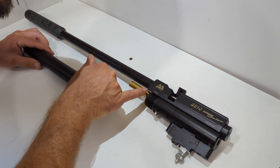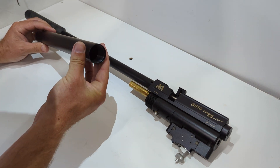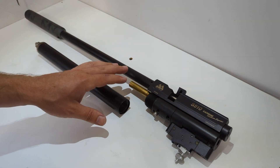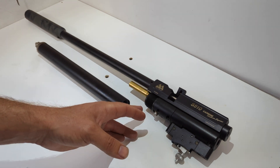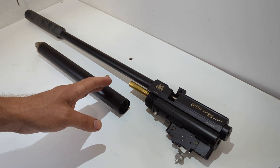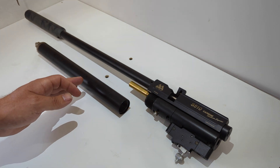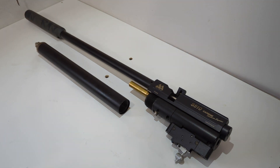Right, so the cylinder's off. There's no signs of any scale, any green verdigris, or anything like that on the pot itself. There's nothing inside the cylinder that looks like corrosion or anything like that — I've tried to photograph it but absolutely can't get a decent picture. You'll have to trust me on that, but I'm quite happy to actually refit this. I'm just going to re-lube it, put it back together, and then get the pump on and see how long it takes to fill from empty. Interestingly, you have to cock these when you fill them. Normally you'd use a dive bottle to give it a quick blast to seal the valve. I'm not sure whether the compressor will have enough pressure quickly enough to fill this even with it cocked, so we may need to get the dive bottle out. We'll put it back together, get it on the compressor, and time how long it takes.